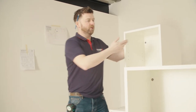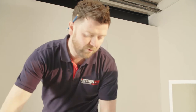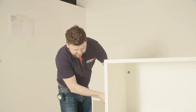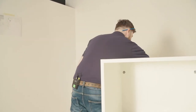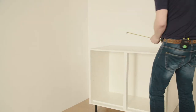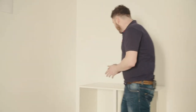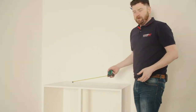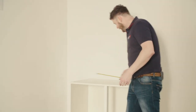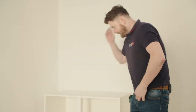I'm going to start off by putting my corner unit in. This kitchen has a blind corner unit, so we are just going to set this into place. This blind corner cabinet we're going to run off this wall 150mm — this is a meter cabinet, so from here the edge of the cabinet will be 1150mm. There's the cabinet in place.